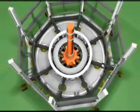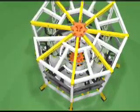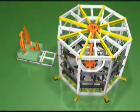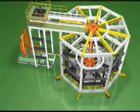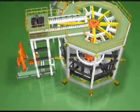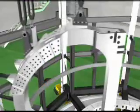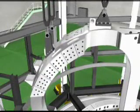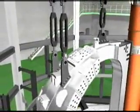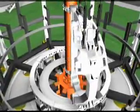After gravity support has been installed, the main jig system for assembling the TF magnet is installed. The K-Star project team has made TF00 coil for cooldown and current charging test of TF coil and a prototype TF structure for supporting the TF magnet.